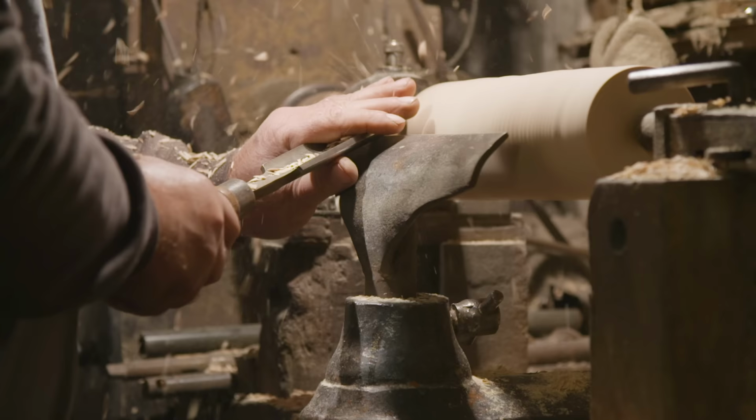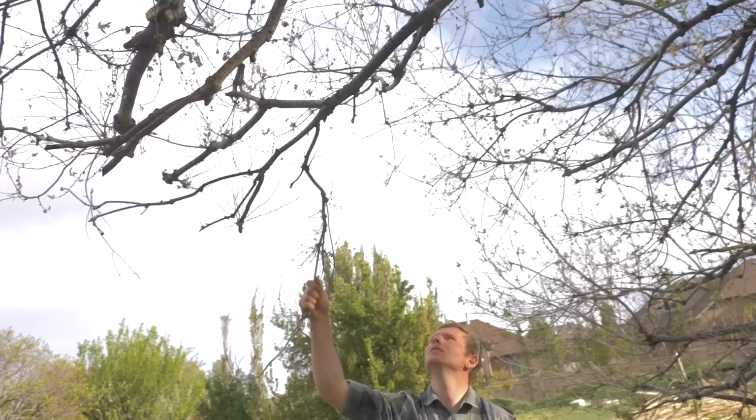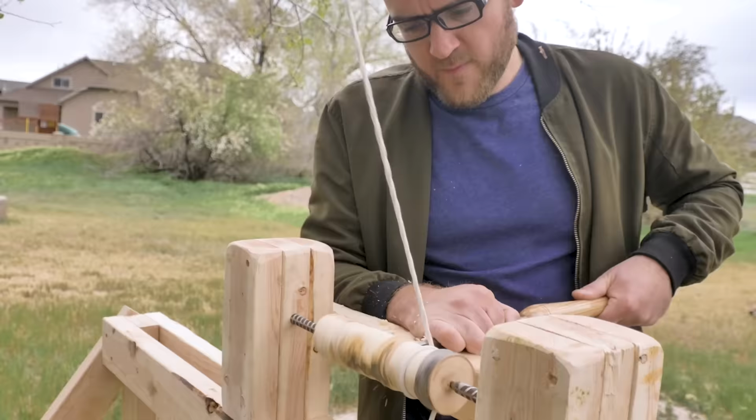One of the most important tools for the Industrial Revolution was a lathe. Earlier this year, I built one of the earlier forms of it, the pole lathe. The pole lathe is an amazing tool, useful for a lot of woodworking, but it also has its limitations. Because it works on a spring, it has to reciprocate and rewind between every press of the pedal.